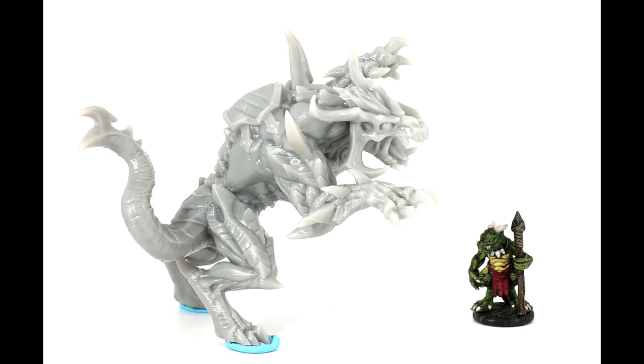To sum it up: this mix of Siraya Fast with Siraya Tenacious is great. People are going to ask what mix I used - I eyeball it. I tried approximately 80% Fast and 20% Tenacious, about four-fifths to one-fifth, and that got me those great flexible results and really nice prints. Cure time was the same as with Elegoo Gray - I didn't have to cure it any longer.